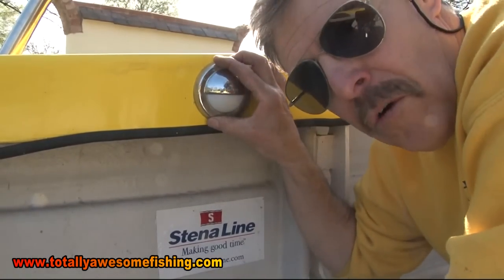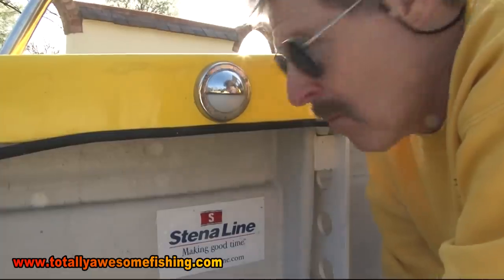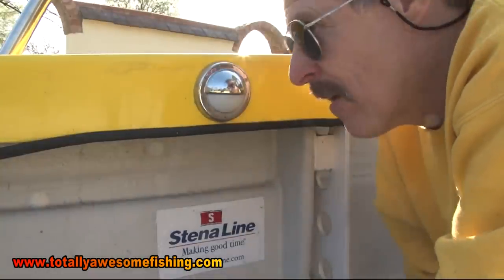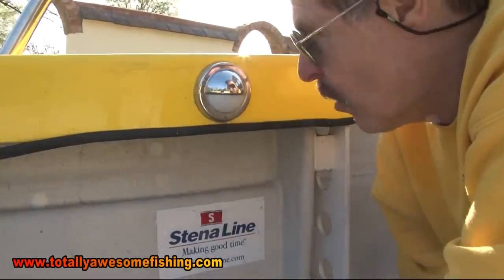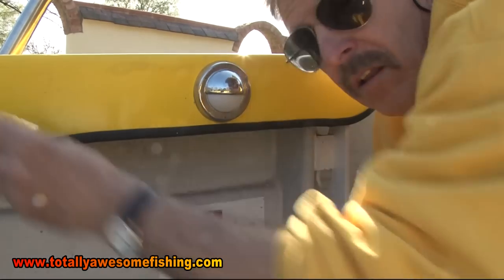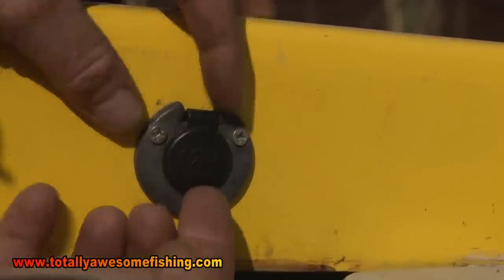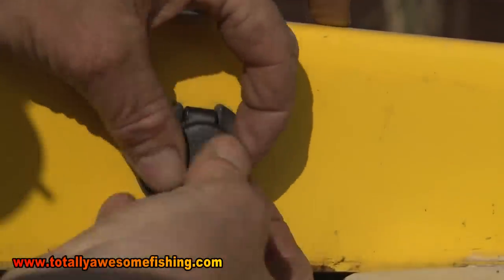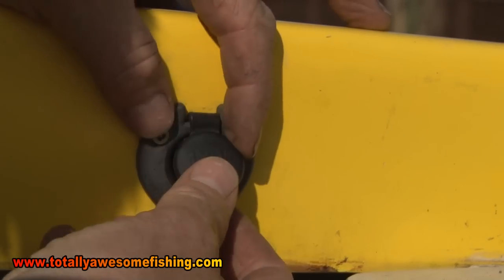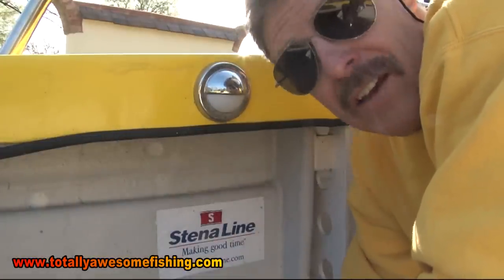These were an extra investment - just side-on cockpit lights, shielded at the top. They light the whole of the deck up without lighting all the outside of the boat up as well, so navigation's safe. I obviously have my main anchor light on at the top as well. This is on a flick switch, and on the other side I've got a little 12-volt socket, so I can put live bait pumps, Q-beams when fishing estuaries, spotlights and stuff like that - auxiliary lighting.